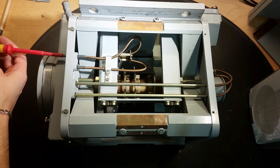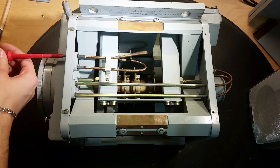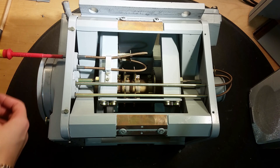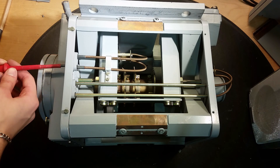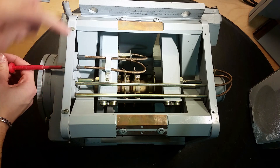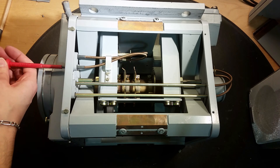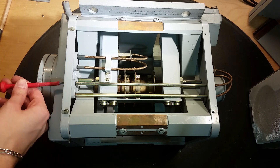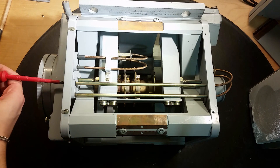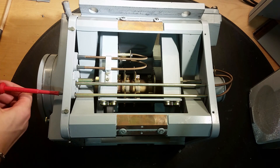By turning that, the whole thing is moving around. By doing this I'm screwing the screw into the waveguide, and by that can change the frequency it passes through. Here's the other ones on the exiting waveguide output - these were pretty nice, not so much resistance on these ones.